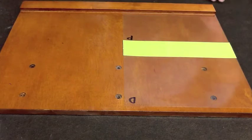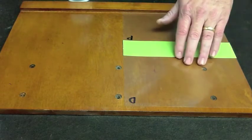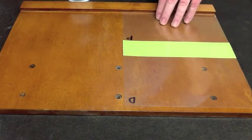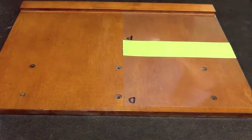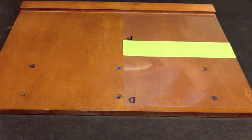During this segment, we're going to talk about the differences between a dye and a pigmented toner. We'll apply it to the panel here. These have a clear coat in the formula, and in some cases you may not need the top coat depending on the durability of the particular application that you're using.